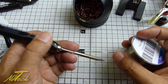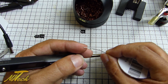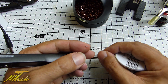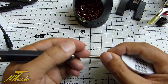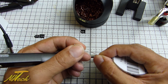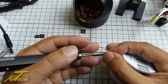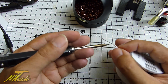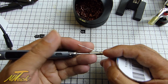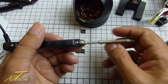One thing I should mention: make sure you have decent quality solder. I don't like lead-free solder — it doesn't flow as well and doesn't finish as nicely. I just use some decent lead solder with flux core. If you're really meticulous about results, use non-cored solder and a flux pen — that will always get you the prettiest looking finishes. Good solder is definitely one part of the equation.